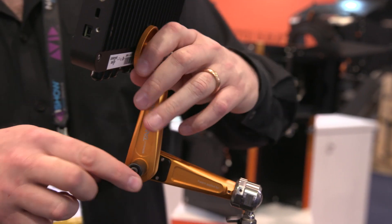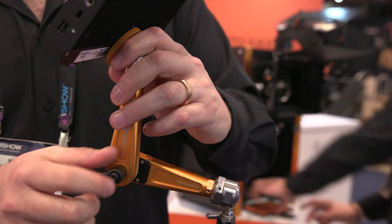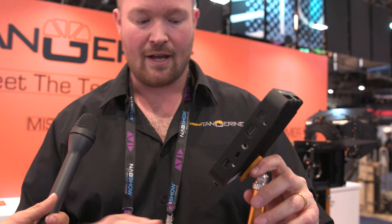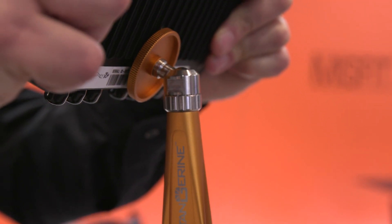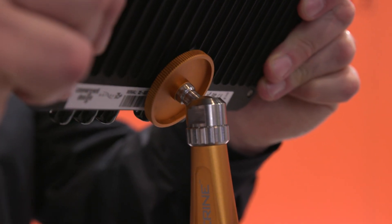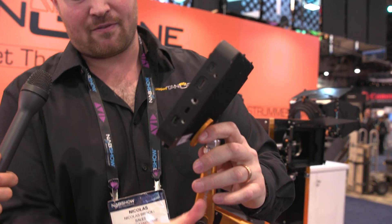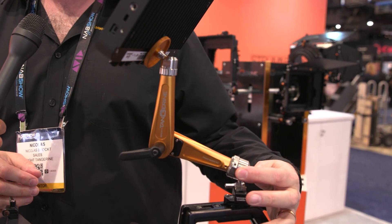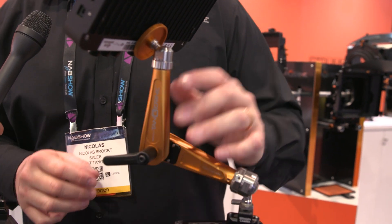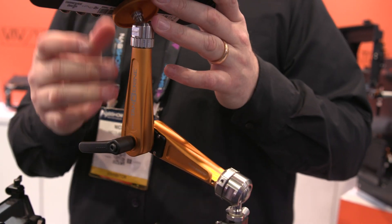So when you loosen it, it won't collapse? It will collapse after a certain point. You've got a dedicated stop here, and then of course it's loose, but you can adjust the clamping force in very non-incremental, basically — it goes up very gradually. That means even though you might have a small monitor with a little weight on it, you can make perfect adjustments and find your sweet spot where you would not have to open up the system in order to reposition it. That said, we all have directors on set that want to yank the monitor or do something with it. So basically, even if I clamp this all the way down, we have designed the system so the forces are distributed asymmetrically. We've got lots of clamping force in this joint, lots of clamping force in the middle, and then a little bit over here, which is enough to support monitors but allows for repositioning. So the friction at all the points is not the same, so you can pivot the monitor without affecting the rest of the joints.